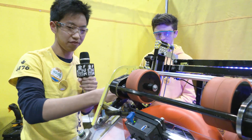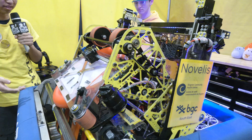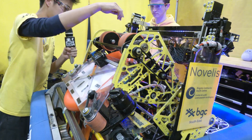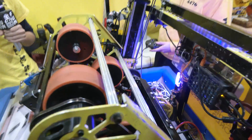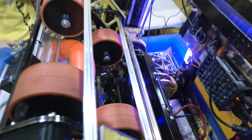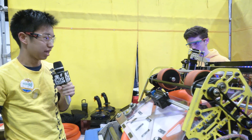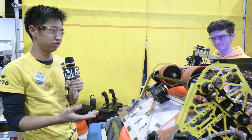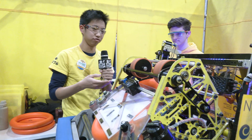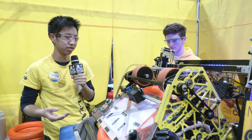Moving on to the pivot — the shooter can be in different positions. When it's intaking, it's in this configuration. We have one pivot motor inside our elevator carriage that pivots the shooter using a chain with a 15:1 reduction. This allows our shooter to have degrees of freedom, and when combined with the elevator it really allows us to have a lot of choice in which type of shot we want to do and a lot of set points.